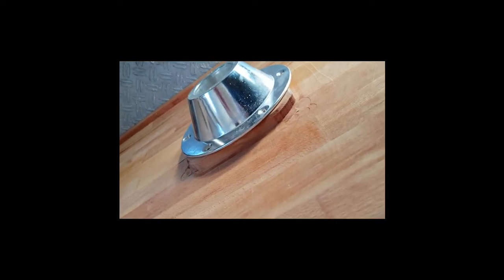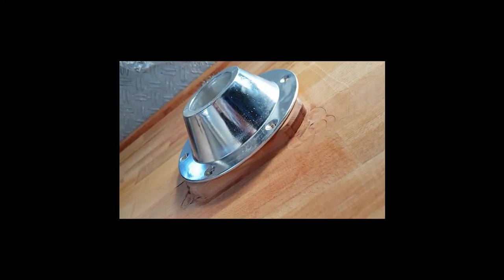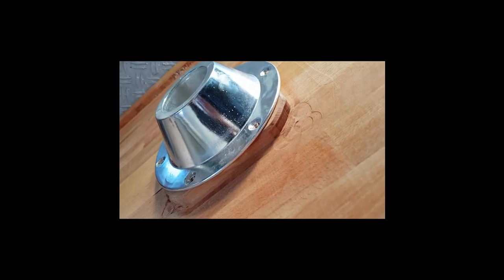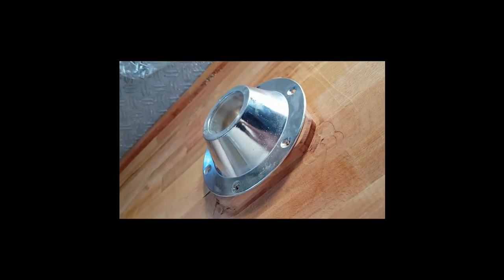The tabletop is made out of beech wood, so I pre-drilled the screw holes a little bit so the beech wood does not break out. With the new mounts, it turned out that I did not quite leave enough material in the center to hold the table, but it's only two screws that are extending over the wood, so it will still hold quite nicely.